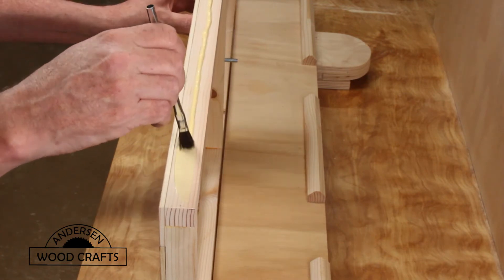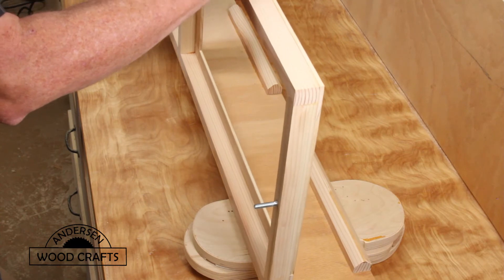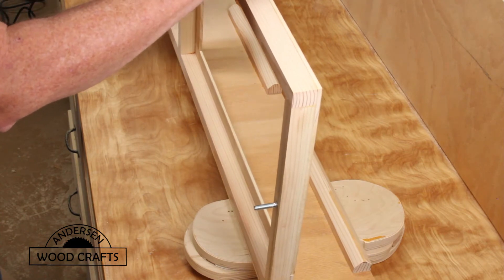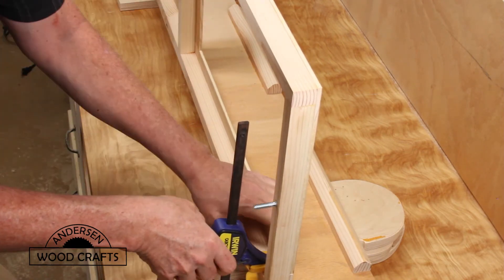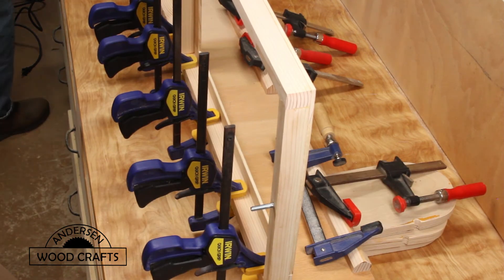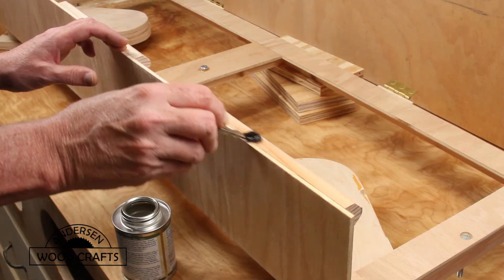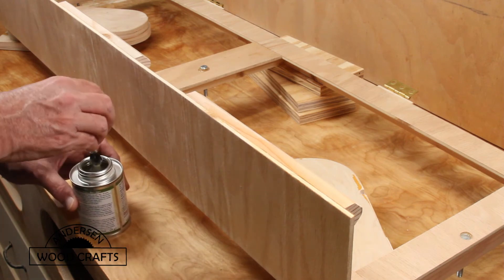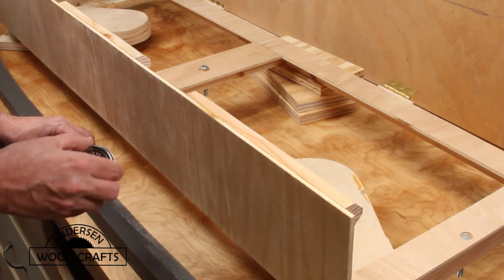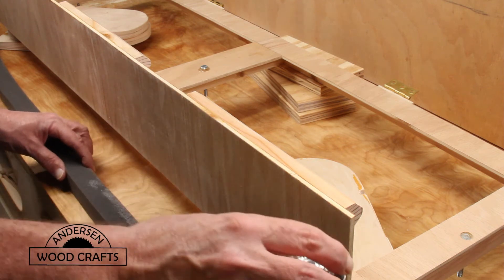The way the box is designed, the bottom is open. I'm going to glue a piece of plywood onto the front to close up the bottom. Again, this will be attached just with glue and clamp pressure. The bottom piece that's on the front frame — the back of it doesn't go all the way to the unit, so there are gaps. In order to fill that gap, I'm going to glue some foam to the bottom piece.